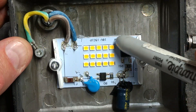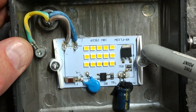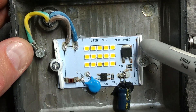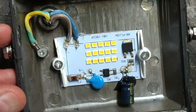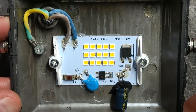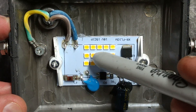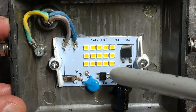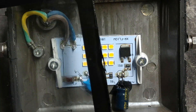Unlike others that clamp the module down with screws and adhesive, this one has little plastic clamps holding it down. That probably allows a bit of thermal expansion and contraction, which would actually make it very reliable. So the weakest component is likely to be the LEDs — and whether you're going to get the black spot of death appearing in them.